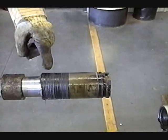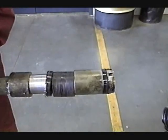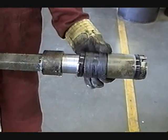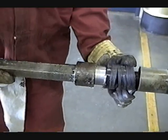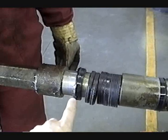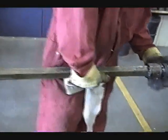Normally you can see your seals there. Point to the piston right — there's the piston. You can see that one seal: the lip seal. Point to the lip seal. Now go back further and you can see the v-packing, and then you can see the other lip seal. The bottom one right here is another lip seal. So there's what makes up your piston packing that goes up and down inside your barrel of your tubing baler.